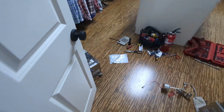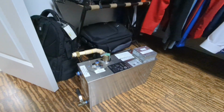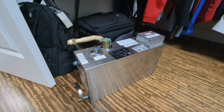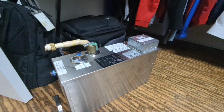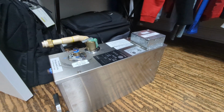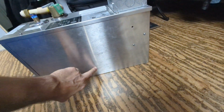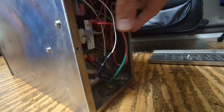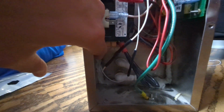And now the tank on this 1733, when I had it, was filthy. And for those of you who don't know, which I did not know, this is on a 50 amp circuit. So when it's energized, it's using about 44 amps of draw. And I found out through the customer care line that actually on this 1733 unit, right in here, there's a tiny little heater blanket. You might be able to see it with these wires. And they actually connect on the side. You see those two little wires?